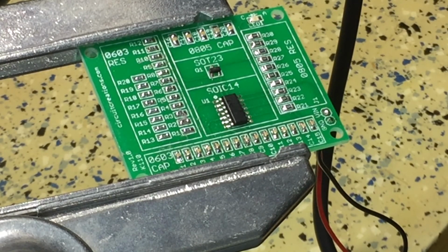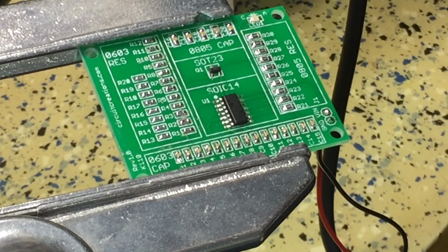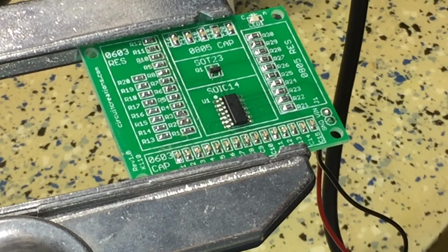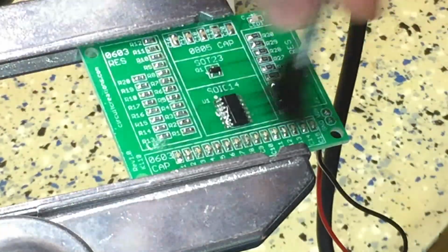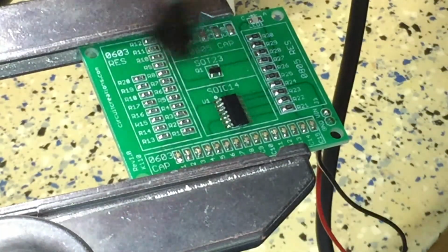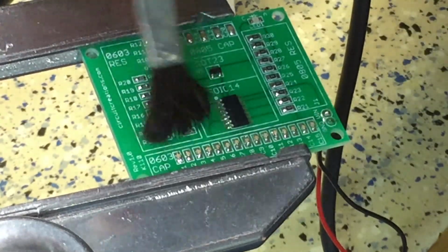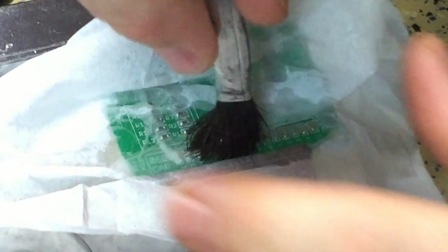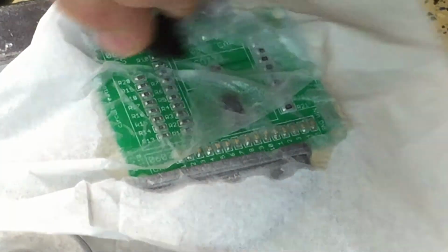And now I know why, because I actually have temporary brushes in here. So it looks like some of the solder flux is underneath the components, and I'm not really able to get under it. I think having the 99.9% isopropyl alcohol will help, because it'll be stronger to dissolve the solder paste. But we're going to work with what I've got right now. Again, for the Arduino project, the actual real Arduino, we will be using everything as best as I can determine is needed and can afford.